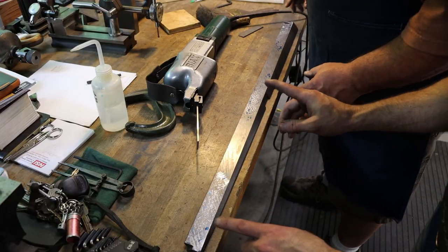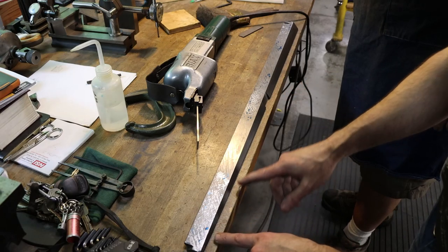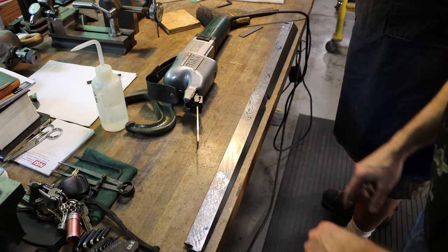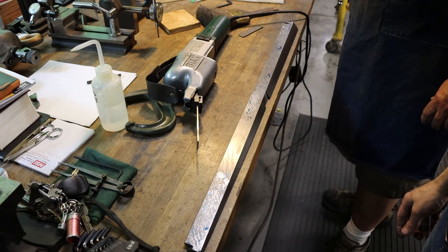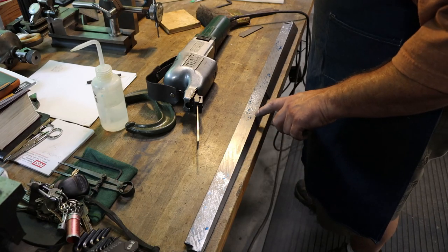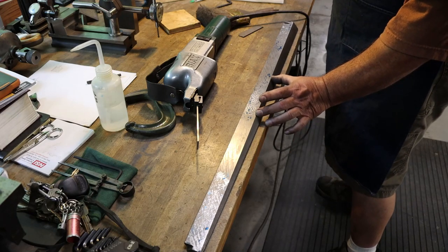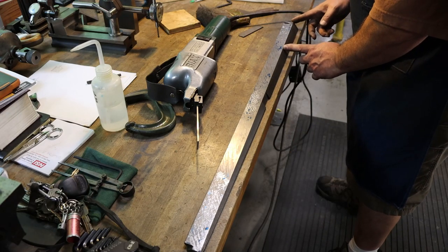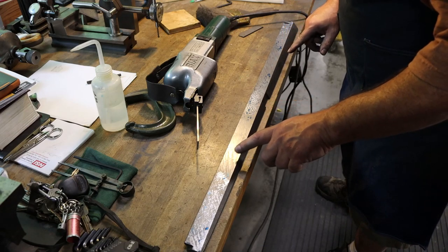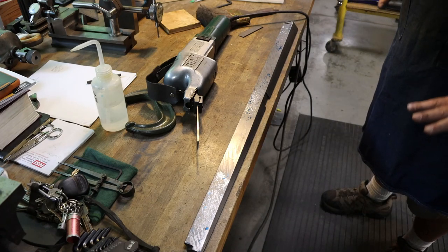So after probably four or five cycles, getting a lot more contact, and it's starting to look pretty good. Yeah, what I'm excited to see is every time we do it, we're getting more blue marks out here in the areas that I haven't scraped. I've scraped this area, this area in the middle, and probably out to about here. But this is virgin area, at least for us. We haven't had any marks in there. So that tells me we're making progress. It's getting flatter and flatter.